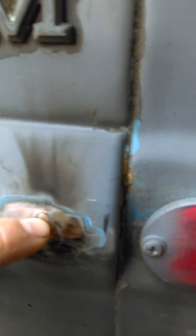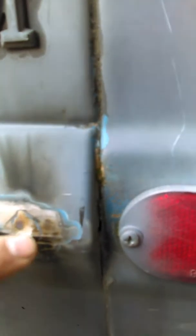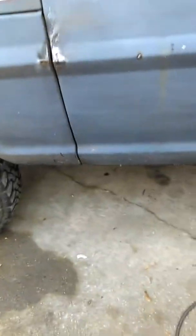You can see back here it was a bigger hole — there's a little hollow spot, an indentation. I'll go back and fill that in, then sand it back down. It's a lot easier to do this with MIG than flux core or stick welding. Stick welding is almost nearly impossible unless you have a lot of experience. MIG welding is by far the easiest and cleanest. Hope you enjoyed the video — don't forget to like, comment, and subscribe, and I'll see you next time.